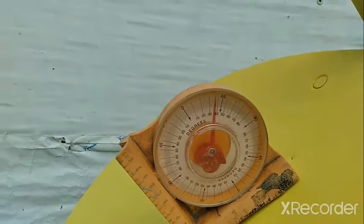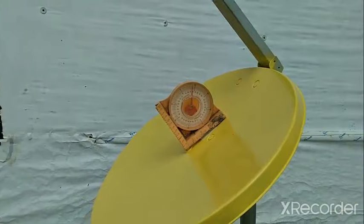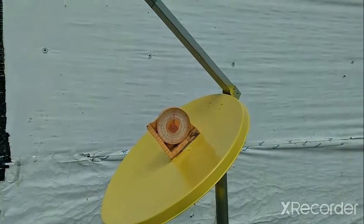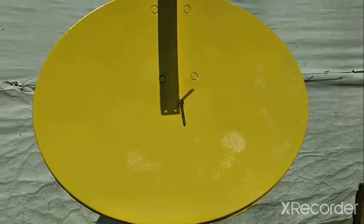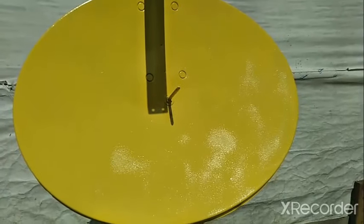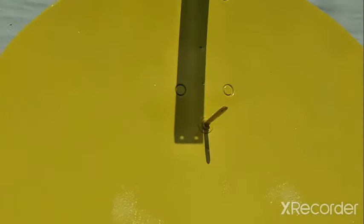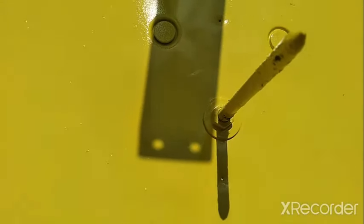If you live really far north, you probably don't have to worry about that part — you're going to have your dish pointing almost directly toward the sun, and the only way to do it is to flip the whole dish around. It's really easy, as you can see. Now let's go ahead and set the dish. Now we can set it in the horizontal position — we can rotate it. To set it in the horizontal position, we have to wait until exactly high noon in our area. Not noon or 12 o'clock, but high noon, which could range anywhere from 11:40 to about 12:20 depending on where you're at. When we're at high noon and we have sun, all we have to do is set it so that the shadow lines up with the preset marks for the vertical line. You can almost see the indention there — to make sure the dish is set perfectly at high noon, I just put the shadow in that indention.